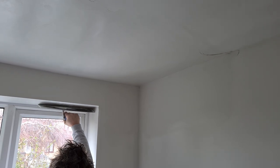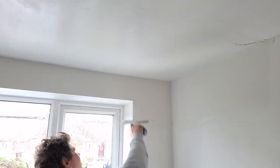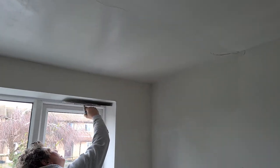When he's spraying and trailing off, you can tell if there's not enough material on the actual substrate, because you're going to hear a scratching sound. And that's the actual grain in the plaster scratching across the surface where it's not thick enough. And when it's not thick enough, that's when you're going to be getting your misses.